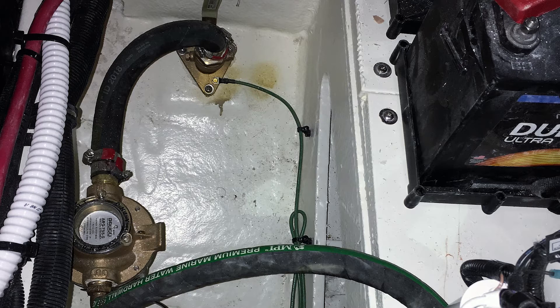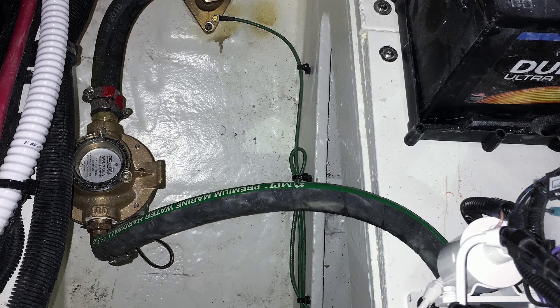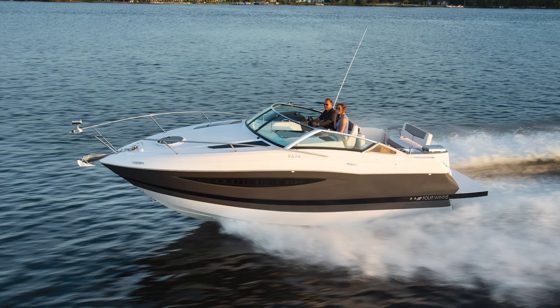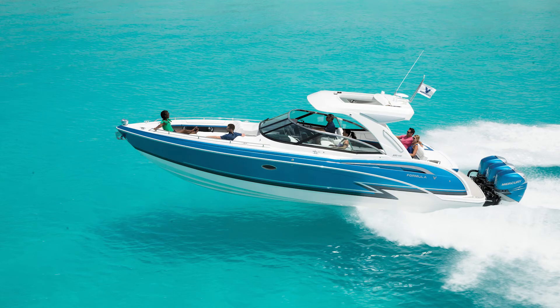Before starting your generator, the raw water through hull fitting must be in the open position. Westerbeke recommends a seawater strainer be installed between the raw water inlet through hull and your generator's seawater pump inlet. The seawater strainer should be checked to ensure no debris exists — if so, it must be cleaned to avoid restriction of seawater which could potentially overheat the engine and cause damage. Be aware that in a no-start condition, the through hull fitting should be closed when cranking the engine multiple times so that the potential for over-cranking and filling the exhaust system is reduced. Over-cranking can cause filling of the exhaust system and water intrusion through the engine's exhaust outlets, resulting in internal engine damage. Be sure to reopen the through hull upon starting the engine.